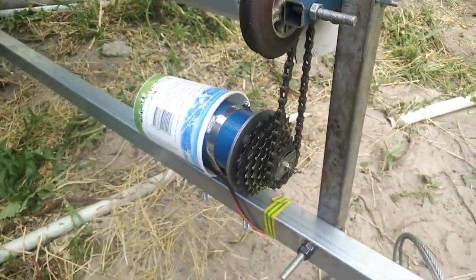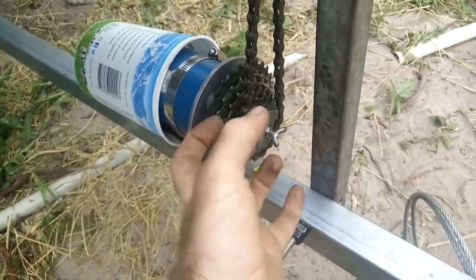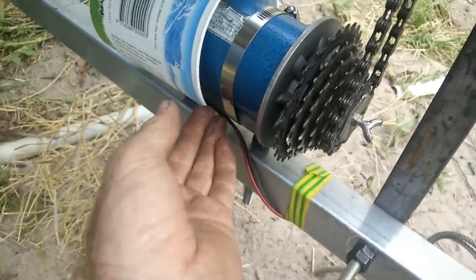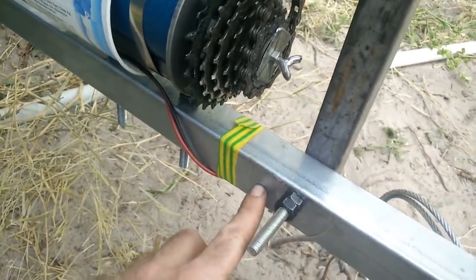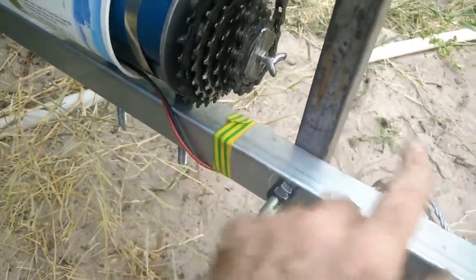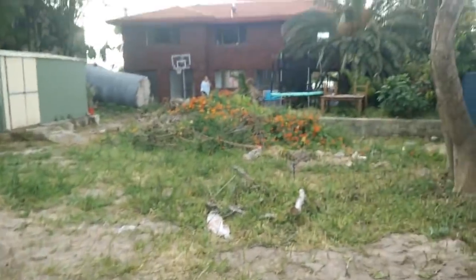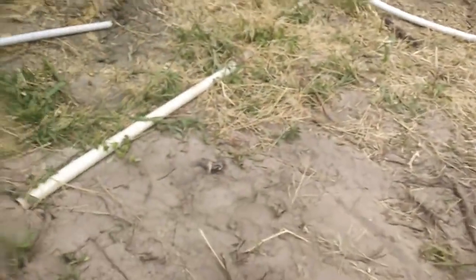And then this is just for a rain guard. It will be quieter when it's upright because the orientation is more tuned for that. And that's basically it — next I just need to drill a small hole in the side here somewhere, feed a length of probably 10 gauge wire down the length of the pole, attach those in, and then that can be buried in a bit of conduit pipe and taken to the house to charge batteries.